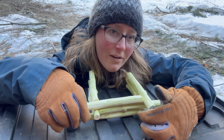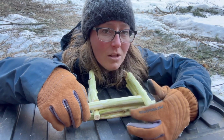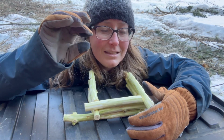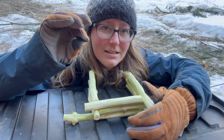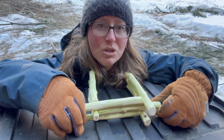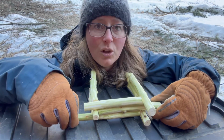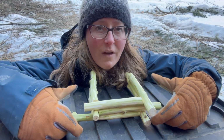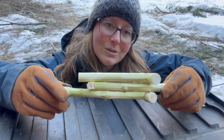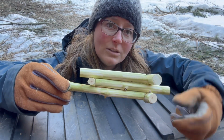So you will have slight little teeny gaps, like the gap between the logs will get just a tiny bit bigger, but it's insignificant. Like you don't even have to go through and add any more chinking if you don't want to. Some people do just for the look, but it doesn't affect the insulation or anything at all. So that's why the house doesn't settle, because it all shrinks around the rebar that's holding it.